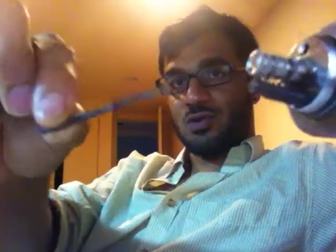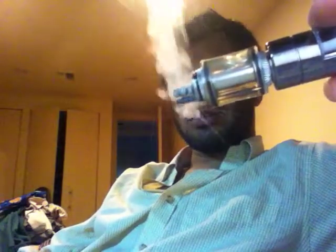And the second modification I did was to enlarge this wick hole to 7/64 of an inch, and I used just a power drill to enlarge the wick hole that was already there. I would like to get a bigger wick hole in there, but you could see how close it is to the threading already. Any bigger of a wick hole would have damaged the threading and would render it useless. So this was the best that I could do with the drill bit that I had, with the space that I had, rather. You can see it's just chugging and chugging. The cutoff is there, but it just keeps going on and on. And I got 1.2 ohms on this.